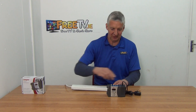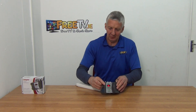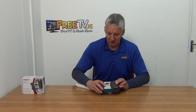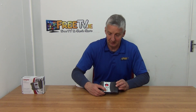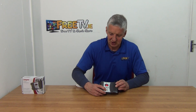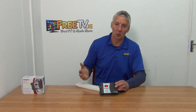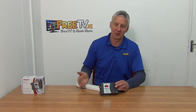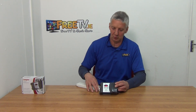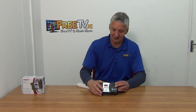What I'm going to do here is quickly demonstrate this — I'll just plug it in directly. When we do this it'll light up, and the default channel number is 21, but you can change channel numbers up and down. The UHF range goes from channel 21 traditionally up to 69, but now because of 4G networks it effectively ends at 59, and soon will be 49 for television.